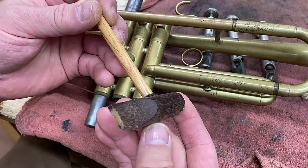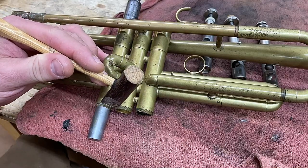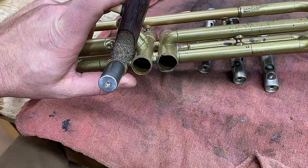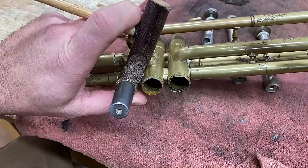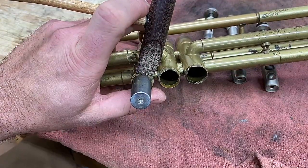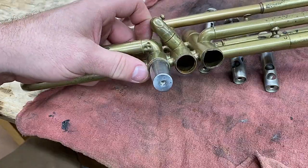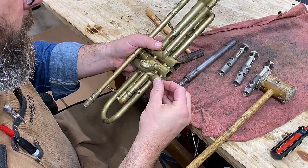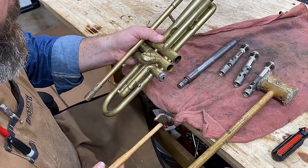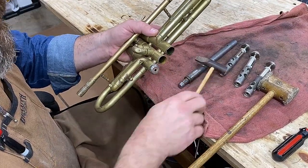Then I use this canvas hammer — this used to be flat, now it's rounded. I put it against the threads. It takes that shape, and then I strike with a hammer using the steel as a form, drawing back the shape of the threads. So once you have this pretty much rounded out, you want to get this back — once you get the lead thread to start, tap it, just like when you're removing.